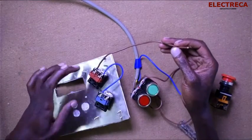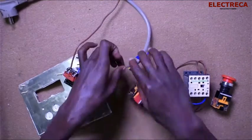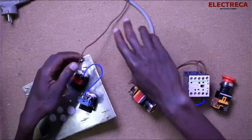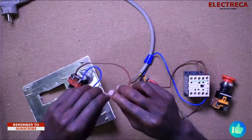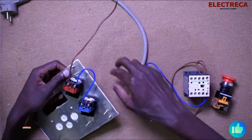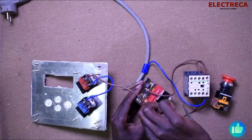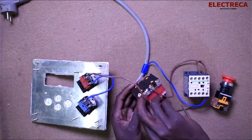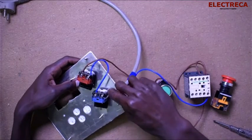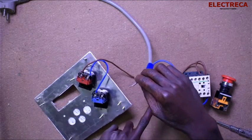From one side of the emergency switch — and I'm removing the supply wire here. Disclaimer: please, if you don't know what you're doing, don't try this at home unless you're really sure, because there will be electrocution and that is not healthy. This wire will now come and feed the circuit — so this one becomes the circuit feed. The supply comes to the lock switch first, then to the emergency, and then to our control.